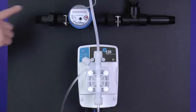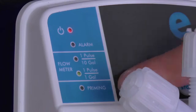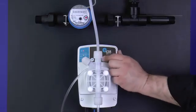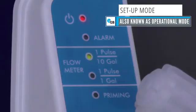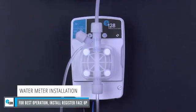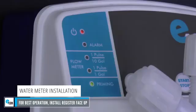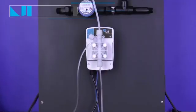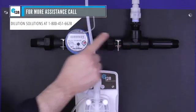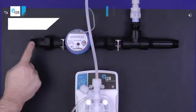Press the F button and select the program to match your water meter — either one pulse per one gallon or one pulse per 10 gallons. Press the start/stop button. The power LED will light up green and the pump is now in setup mode, waiting for a signal from the water meter. Please be aware: the pump will go through a complete cycle on the first signal from the water meter. On the second signal, the pump will slow down and pace out the chemical delivery. The E128 learns the water flow and adjusts the strokes accordingly.